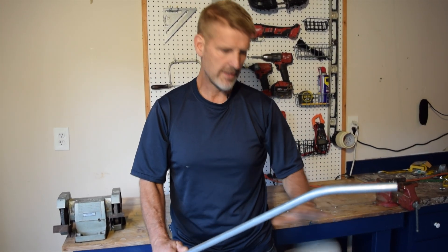I did that without even looking, and it doesn't maybe seem like that big a deal. But if you're doing this all day long and bending pipe after pipe, it's going to save time. You're not only going to make better bends, but you're going to do them quicker. Where this thing really shines is with the offset bend. Because with an offset, it's not just one bend — it's two bends, and those bends have to be exactly the same. That's what I love about the Hoppy Bender: it allows us to make perfect repeatable bends.